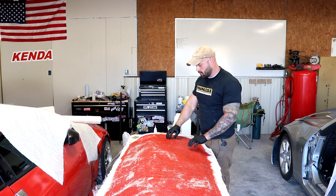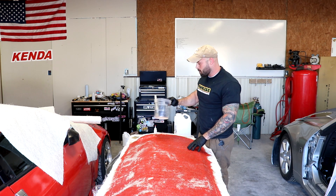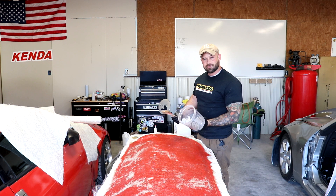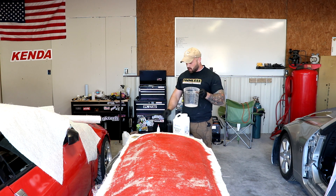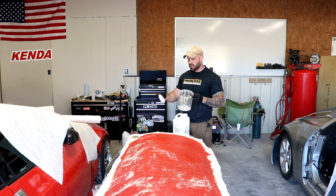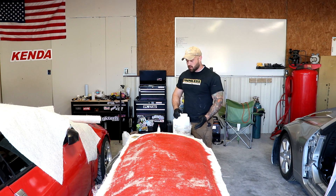We've allowed the fiberglass to cure overnight — it's pretty hard, which is great. We're going to do at least one more layer for strength; I think I'm actually going to finish out all the fiberglass I have. This is why using the proper container is important — it's reusable. Same as before: we're going to add our resin and MEKP. I'm going to do 48 ounces, so that will be about 16 cc's of MEKP. We'll wet out the rest of the fiberglass, and before the very last layer I need to mix in the wax so it can fully cure.